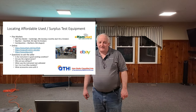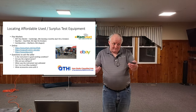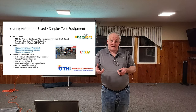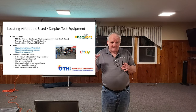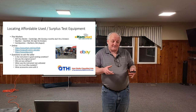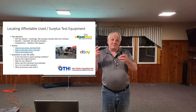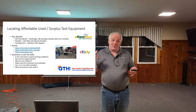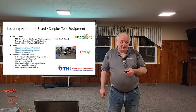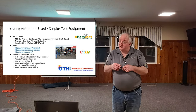So, again, before, I was able to figure out, well, it's not the antenna per se. When it's power related, it's not my transmitter. It's got to be something in the antenna. Well, what's in the antenna that changes? Got to be the balun. Could be the coax, I doubt it. More likely the balun. So, buyer beware.